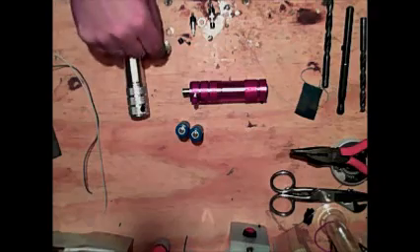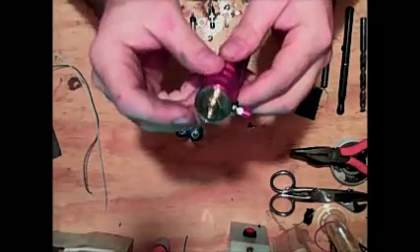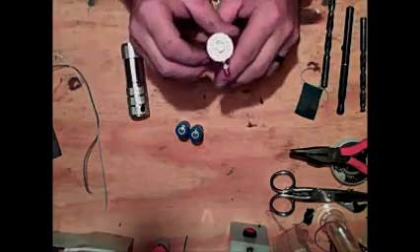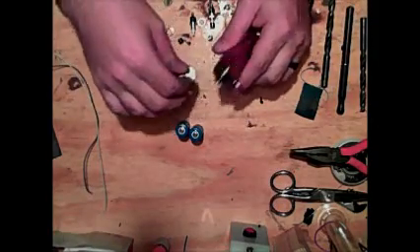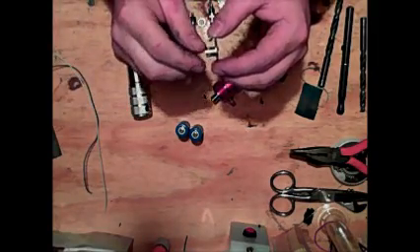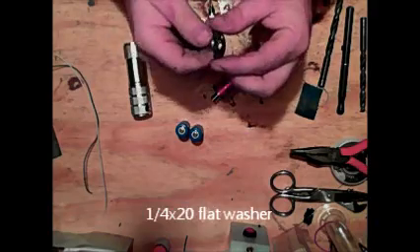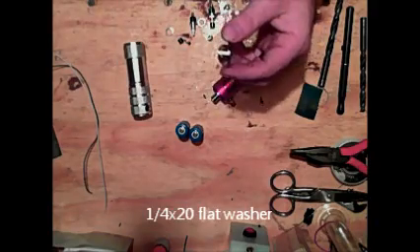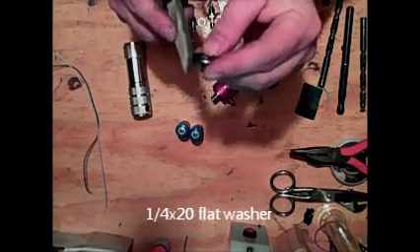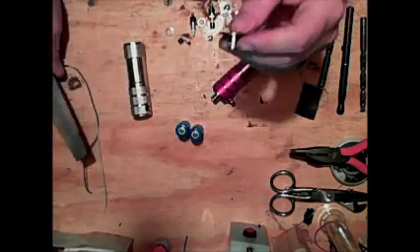Once you do that, you'll have your top assembly finished. That is one of the major steps. I chose these flashlights because they're about the diameter of a quarter. This was a quarter-20 washer available at any hardware store that I drilled out the center of — I put it in the drill and took my file, held it as the drill spun on the washer until it got to the appropriate size.